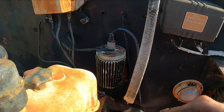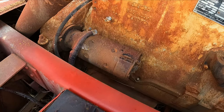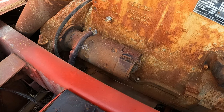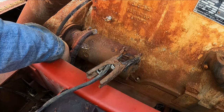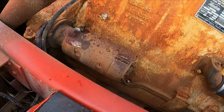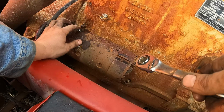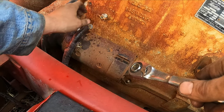Before I do that, I'm just going to run the wire to the starter so we can see if we can get it to spin over fast enough. What I'm going to do is clamp my battery cables on there. First I'm going to remove this cable so it doesn't back-feed into the truck and start a fire. I'll stand far back just in case it's stuck in gear. Here's a little tip: whenever you take nuts and bolts off of stuff — let's say you pull an alternator off or a cable off a starter — go ahead and put the nut back on. That way 20 years later the next guy can just take the nut off, take the cable, and tighten it back down.